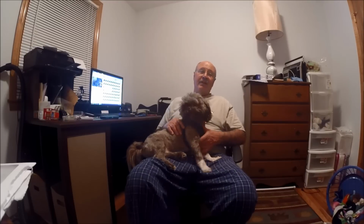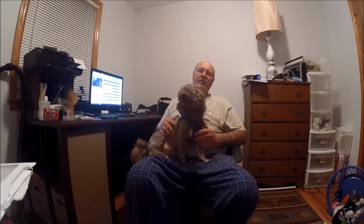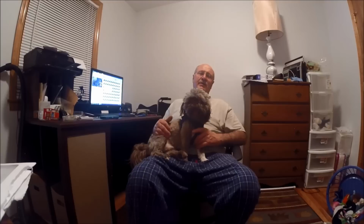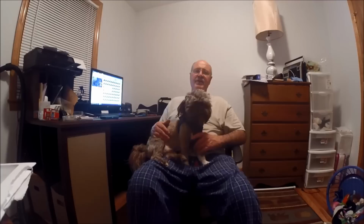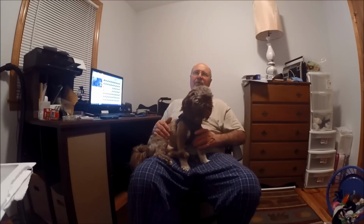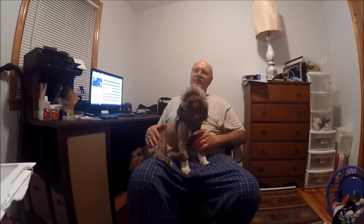That's about an hour or two from here. And I saw an unknown lathe that looked like an American lathe in Winston, in a guy's basement, on Craigslist. They wanted $1,200 for it, and I actually tried to contact him, and he never emailed me back. So I guess he wasn't interested, or somebody else may have contacted him and bought it. Because basically, lathes around here go pretty quick. Eventually, I hope to have a better lathe. Now, mine works. The biggest thing I don't like is it doesn't have a quick change gearbox. If I decide I want to do single point threading, I have to put the change gears in. It's not that big a deal, but kind of makes me avoid it.